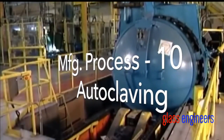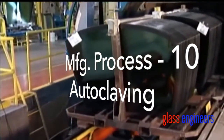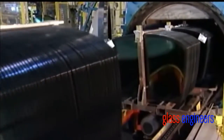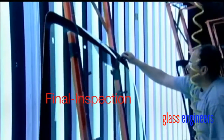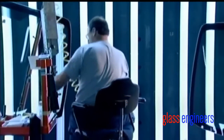This big blue chamber is an autoclave — it's like a pressure cooker. After about an hour in there, any remaining air pockets in the windshield are removed. A rail system transports the tub full of windshields to the inspection station. Here, each windshield undergoes a close-up inspection by a human, who searches for scratches, chips, or any contamination between the glass and vinyl layers.